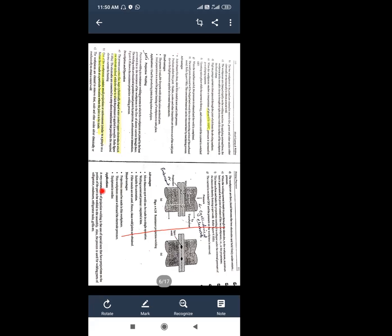Now you can see some applications. A very common use of projection welding is for special nuts that have been projected on the portion of the parts to be welded, so as to assemble. The process is used for welding parts of the refrigerator, condenser, refrigerator racks and grill. Sometimes there are nuts and bolts just like a rivet. Have you seen how rivets are joined? When the nut is placed in the rivet, it is hammered to get a dome shape. At such a time the nuts are melted over there. Understood? For such types of application, this resistance welding process is used.